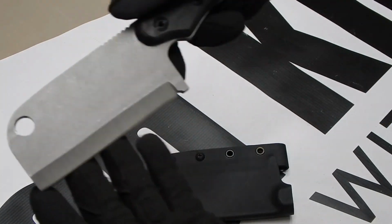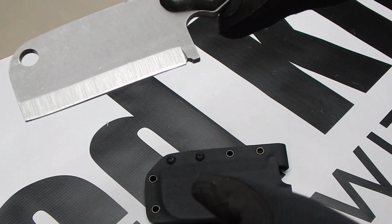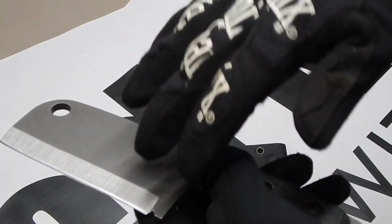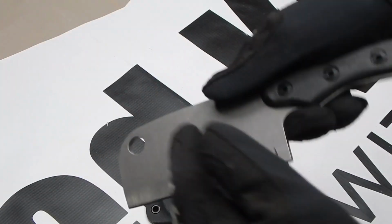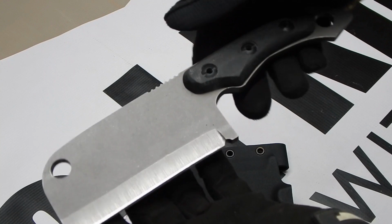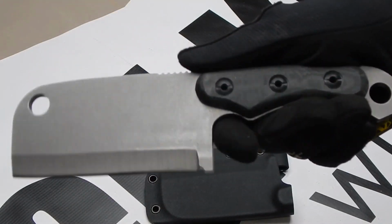It also looks pretty cool how we have that stonewash, and yes, through the process the blade here is stonewashed, so we put the blade on, then throw this in the stone washer, and it comes out to this pretty cool finish. The knives first come to us sort of like a very dark gray, so the stone washer actually lightens the color of the knife here.